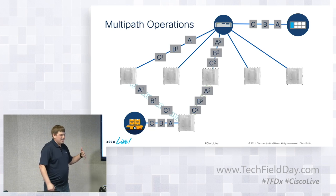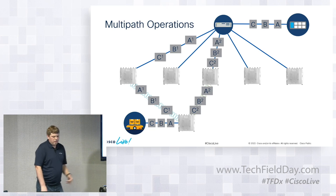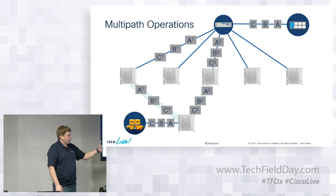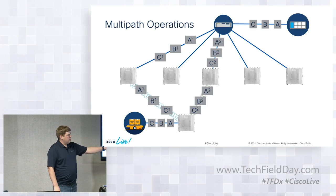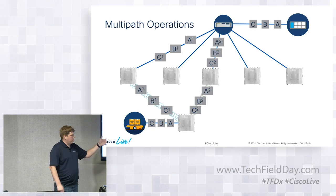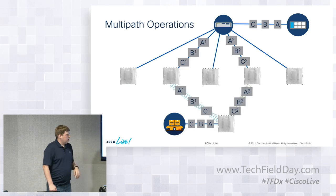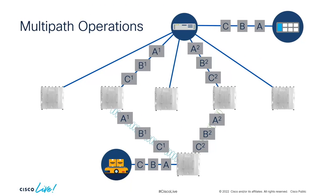Here's the more complex factory version. You have the same AGV, but now multiple access points are deployed across the factory floor. Using our Cisco Ultra-Reliable Wireless Backhaul (CURB) technology, we send packets to different base stations and they hand off as the mobile device moves across the floor — across different access points on the same or different frequencies. Those connections move with you, rerouted across the network, across wire infrastructure and wireless.